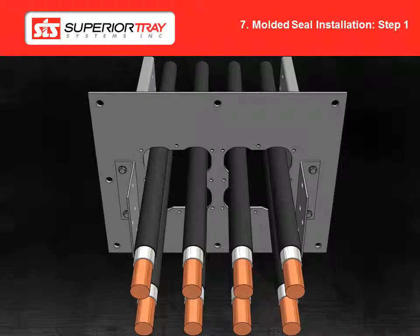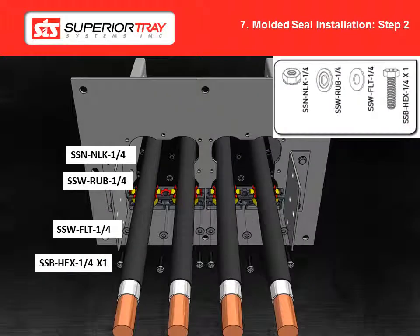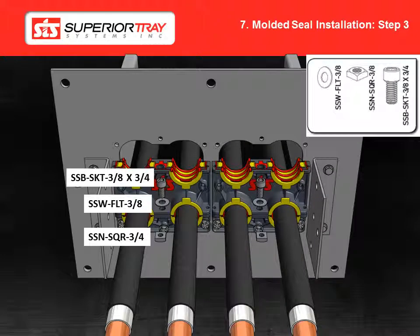Step 1: Pull all the cables through the seal plate, using caution to avoid damage to the cable insulation. Prepare the cables for termination. Ensure that sealant is used for mounting the plate to the wall or to the equipment during seal plate installation. Please note that the cable bus enclosure is omitted for clarity in the image shown. Step 2: Install the bottom block using the hardware shown on screen. Leave bolts hand tight for now. Step 3: Suspend the upper row of cables while securing the lower row. Bolt the middle block to the bottom block using the hardware shown. Torque the bolts to 60 inch pounds or 5 foot pounds. Please note that in the image shown, the second row of cables are not shown for clarity.